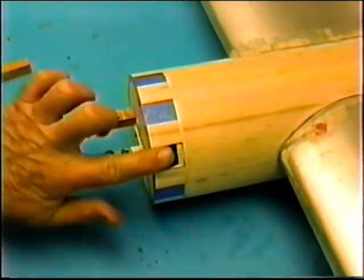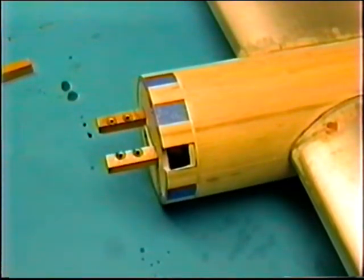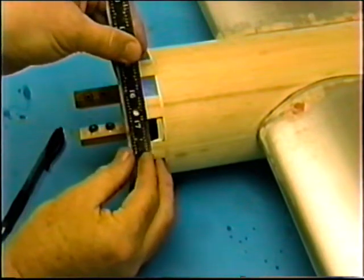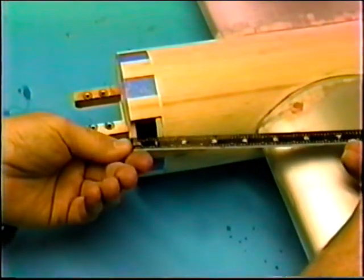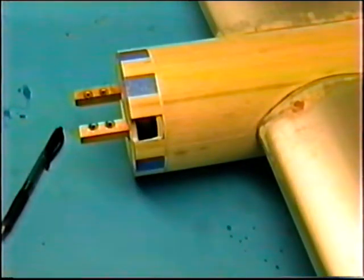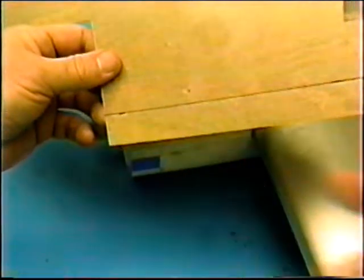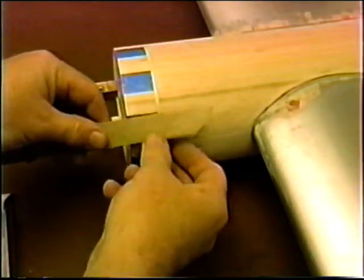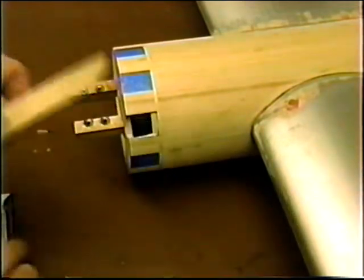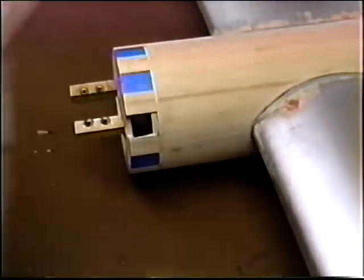Now to cut the plywood, I want this to be a flat. I don't want to just have it touching on a little area. I want it to be touching on two flats. Let me just see how thick that has to be. Probably the easiest way to do this is just to strip off a big long piece and then cut it to length each time I put a piece in there, because you can use up scraps, say this is 64th plywood. It's always good to cut the piece a little bit oversized. In this case, it just won't fit in there. Again, because I'd like to get nice tight fits, there's going to be some structural integrity here, that would go a long way.